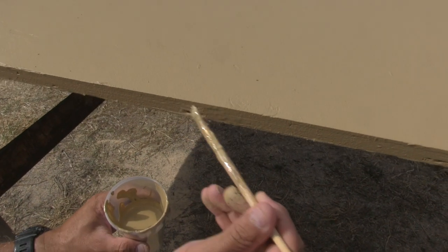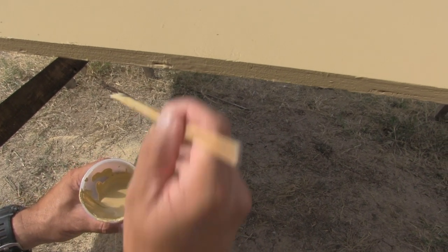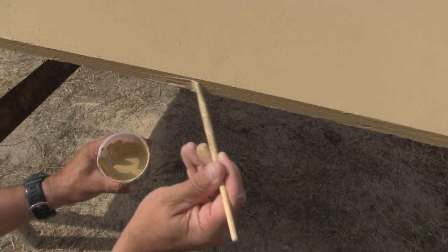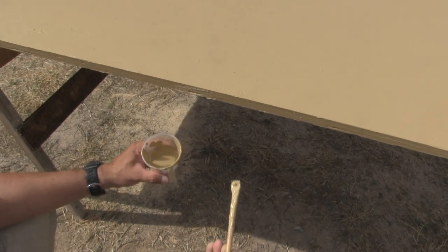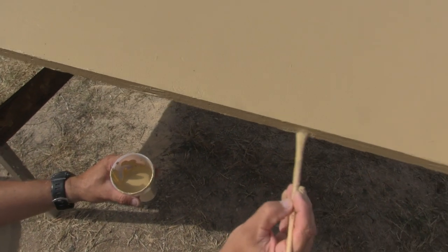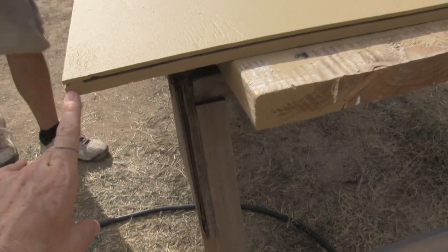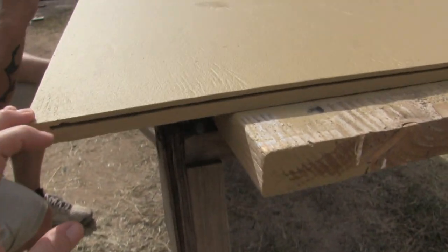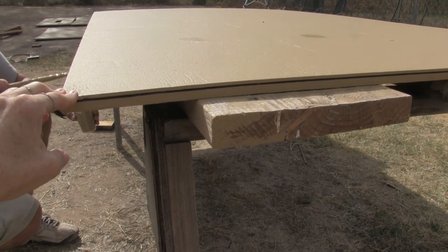So some of these sheets of plywood have these gaps and cracks along the edges, which would be a disaster to get water in. So we're trying to completely fill those little crevices. And this one keeps opening. Yeah, gravity is not being your friend. Now, if we can't get enough product to stay, especially the big crevices, like over here, the crevice is so big and so deep that I don't think we would be able to get the product deep enough in there and it wouldn't stay, it would run out. So maybe we're gonna fill that one with caulking.